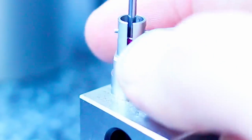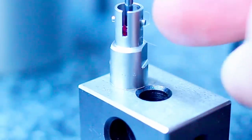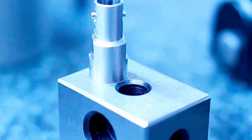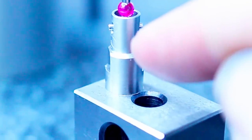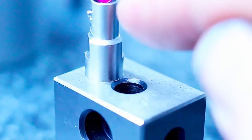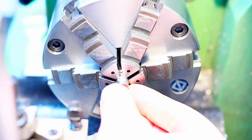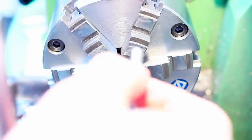down into the 60 degree countersink in here, that I showed you in the cross section, giving a little bit of preload on the probe, spinning the part on the ruby ball to seat it properly. Then I take a measurement, and this is my top to ball dimension for the countersink, and that's within 30 microns here. That's good. So to do my end machining, I need about 6 to 7 millimeters of overhang. Means I'm on the last serration of these hard jaws.